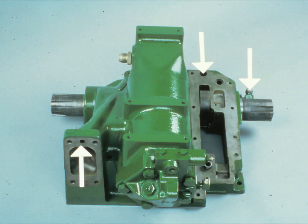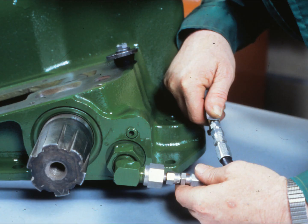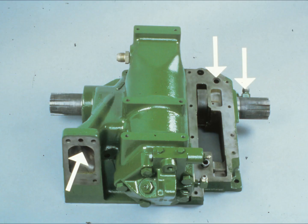On a mechanical sensing rock shaft, install rubber plugs in the front pressure bore that goes to the control valve and the pressure bore for the left-hand SCV and secure them with plates. Then install the special pressure control valve body and apply air pressure with an adapter. There shouldn't be any leakage unless you left the regular pressure control valve body in — then there would be slight leakage past the bleed hole. This shows you the return passage we'll be checking, which is the same on both types of rock shaft. The procedure is the same too.